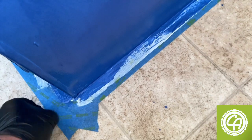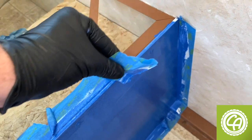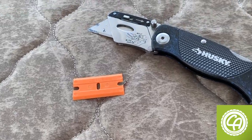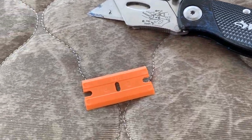We're in the middle of our final coat now — it ended up being three coats total. We got a gallon of paint, which was twice as much as we needed. As soon as the last coat is on and we're confident it's done, we're going to pull the painter's tape off while it's still wet — have something to wipe with as you pull it because it'll be messy, and you don't want to wait until it dries or it'll be stuck. Also a must-have: a razor blade or plastic razor blade — very inexpensive and it helps cut away anything stuck on the sides.